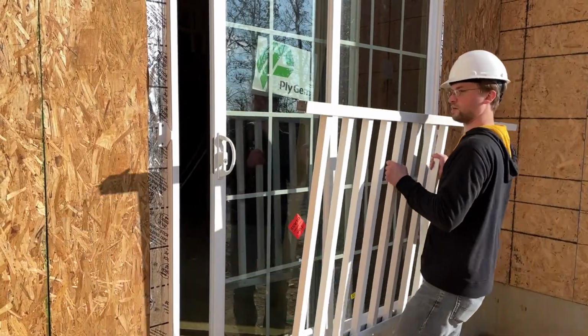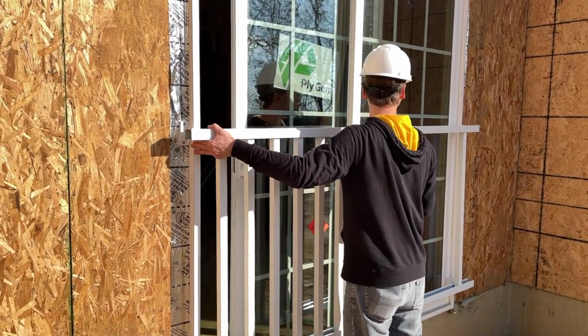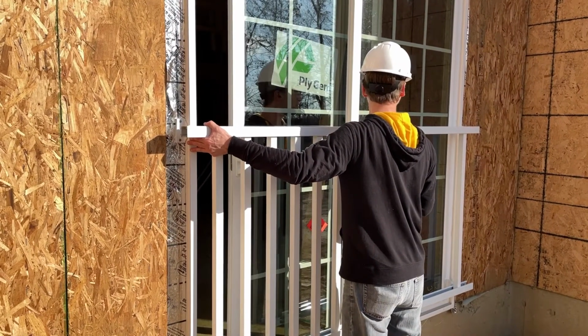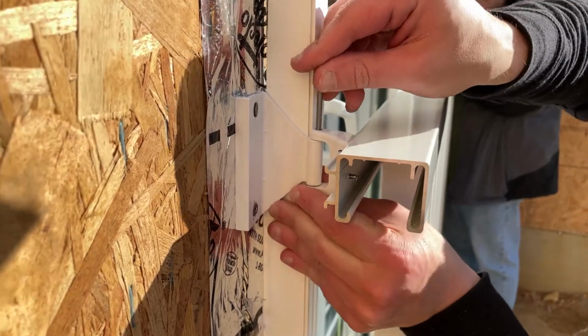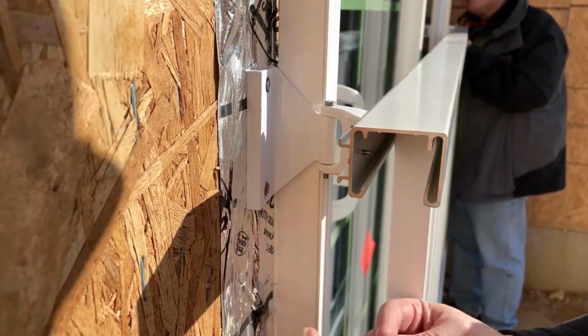Position the rail in place. You should be able to rest the top rail brackets on the wall brackets to allow insertion of the bracket screws. Insert bracket screws through the wall and rail brackets and secure with hex nuts for both top rail brackets.